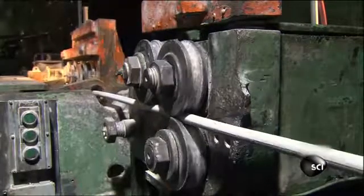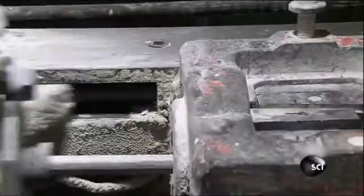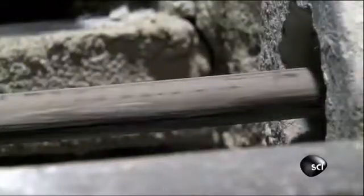Because if there's even a little kink in the steel it could turn into a weakness in the bolts. To iron out the kinks, the wire is tugged through a set of rollers to roll out the bigger bends and waves. A second machine yanks the wire through a tiny hole, or die, that's slightly smaller in diameter than the wire. The force of squeezing through the narrow die makes the wire straight and smooth, and also reduces the diameter of the wire to exactly three-quarters of an inch — just the right size for bolts used to connect the steel girders inside buildings.